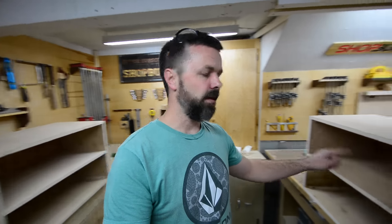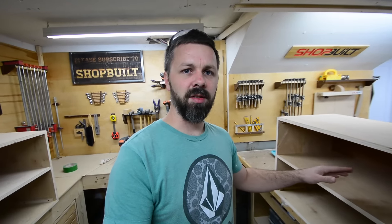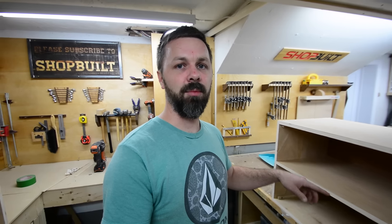That pretty well wraps up the construction of the case. These are going to have drawers — two drawers in each of the cabinets. On the inside I want to put a bare finish, because I like the idea of seeing the maple on the inside and the paint on the outside. There's going to be a maple edge banding going all the way around that will be painted the same color as the case. So I'm thinking: bare finish the inside now before the edge banding goes on, then tape it off, put the edge banding on, and paint it the right color.